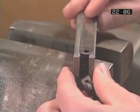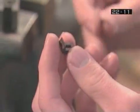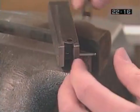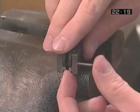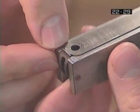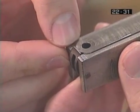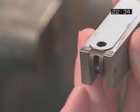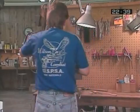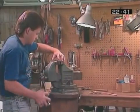Okay, very slowly. And where's the sear? Let me see the part. It's here. Okay, what are you doing? You're sticking it into the... It's got just a sear pin, like in a gun, that holds the sear in place. And what are you trying to cut off? What you're cutting is the face of the sear. And just a little bit, I guess, right? Yeah, it's not very much. You're just going to make it level with that sear jig. Right, that keeps everything working like it should.